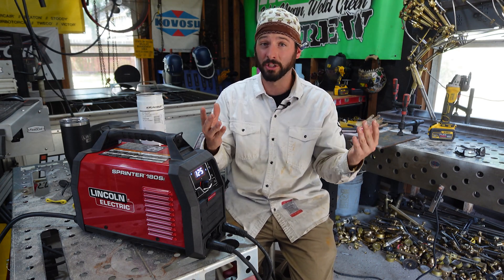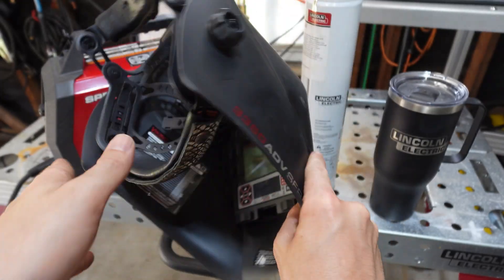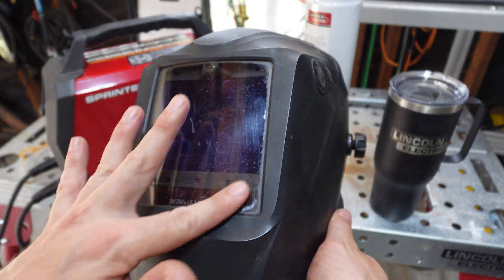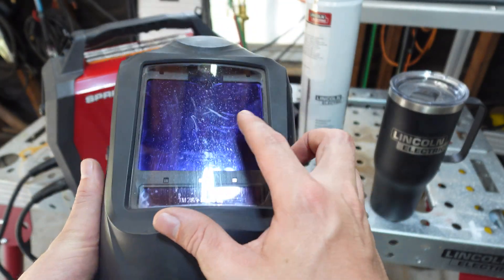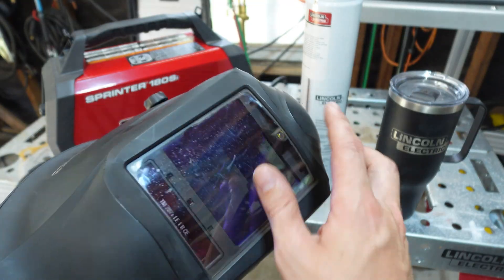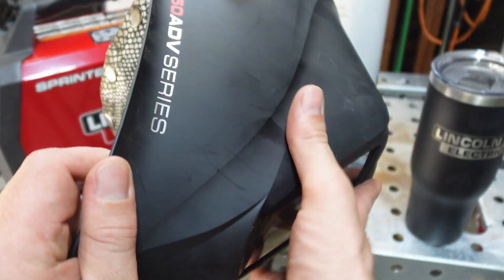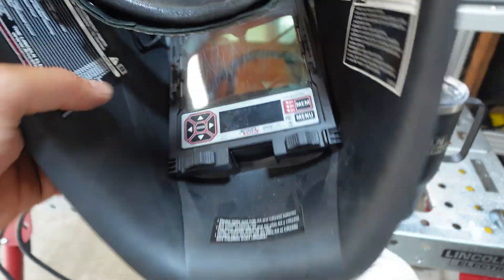The second thing I want to address if you're still having a hard time welding in a straight line: can you even see? Repeat after me — you can't weld what you can't see. When I pop your hood, the first thing I look at is your clear lenses. Some students never replace them or never even put them on, and they ruin the ADF on the inside. When you're welding every single day, you should be changing those out almost every day.